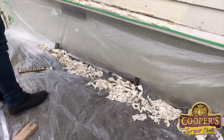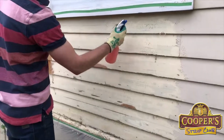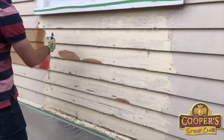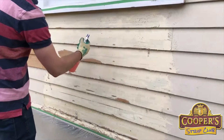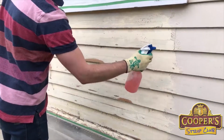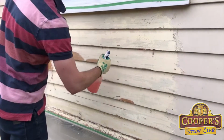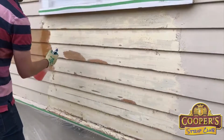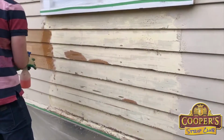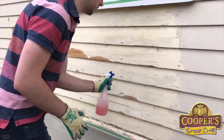So now we're on with more stripper. This time we're getting at the enamel paint, and we've also got access now to the lead. Lead's a major thing in New Zealand. We're continually poisoning ourselves with lead dust. We think sanding is a more eco way of doing things, but all you're doing is grinding up lead to spread around, and it's just not good. Even your heat guns, they're vaporizing the lead. This system is wet, so there's no lead dust, and it's all controlled.